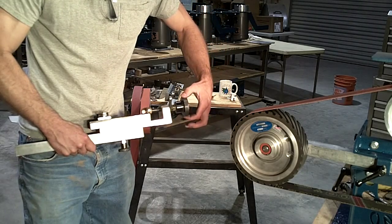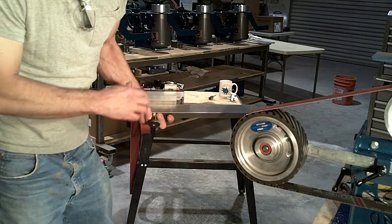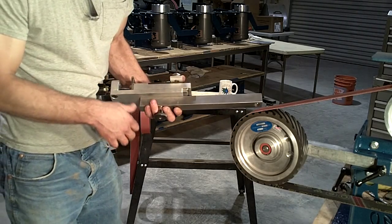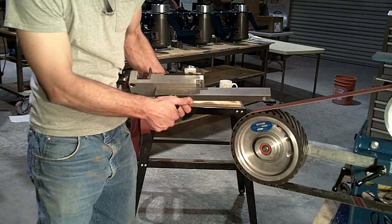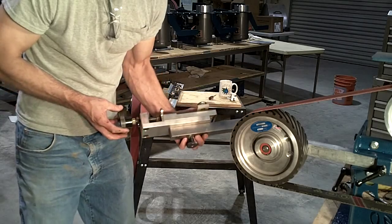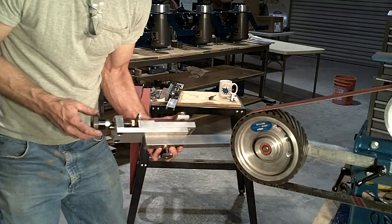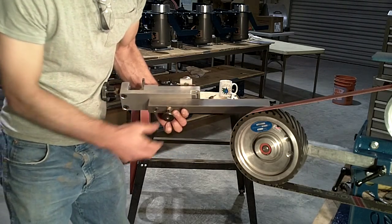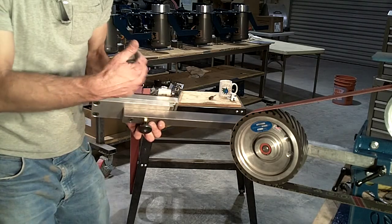One complete revolution is 50 thousandths. On this slide — and I'm not going to go into details of the slide — but it's not a typical dovetail and I think it's actually more suited to this application. The tension of the slide is down here so you can actually spin and make fast movements, and then tighten it down when you actually want to surface grind and apply your force.